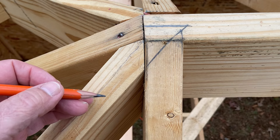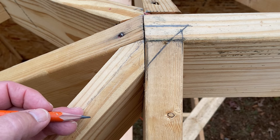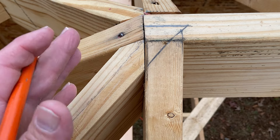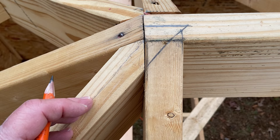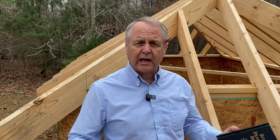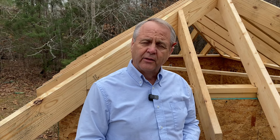And since the rest of the jacks are based on the length of that first jack rafter, it means all your jack rafters are going to be too short. And that's a real problem because when they're too short, they will skew off of layout. Your roof decking is not going to break on your rafters. And your jack rafters, especially your shortest jack rafters, are going to run out of square. The truth is that carpenters have been using these construction calculators for a long time without even realizing their jacks are too short and the rafters are skewed out of square — they've been fighting it without realizing the origin of the problem.